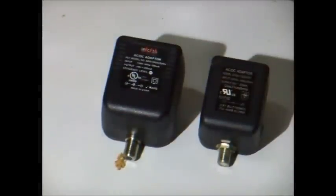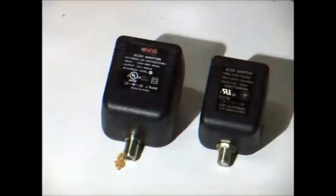But between the preamp and the distribution amp, I ended up with these two wall warts plugged into the wall. My kilowatt meter shows they each use 6 watts of power, or 12 watts total, creating a vampire load. On closer inspection, both amplifiers required 15 volts DC. I have 12 volt DC at my solar battery bank, so I replaced these two vampire loads with one of these.